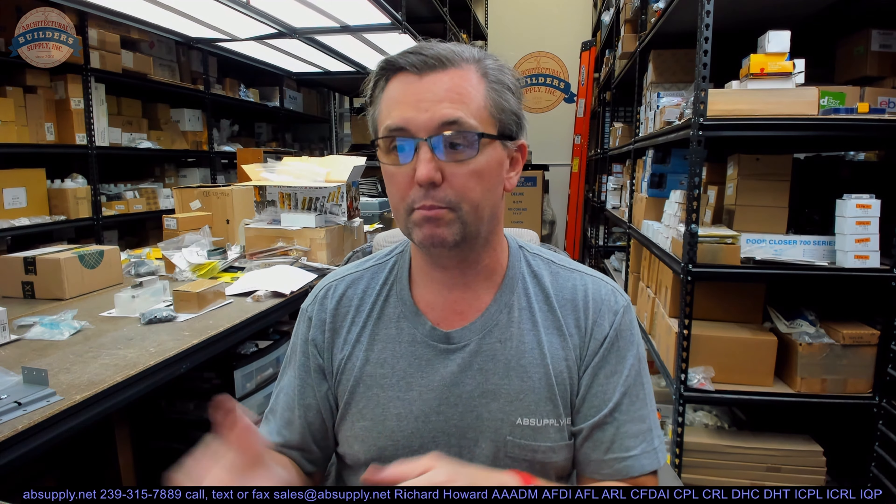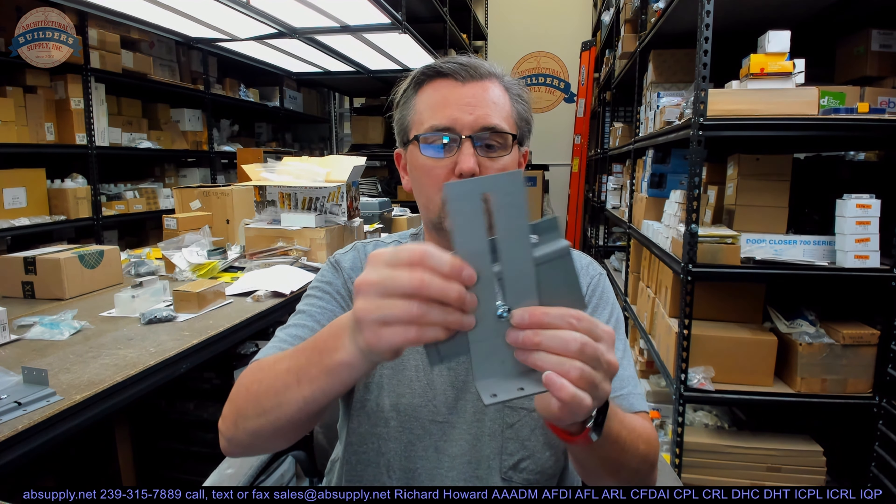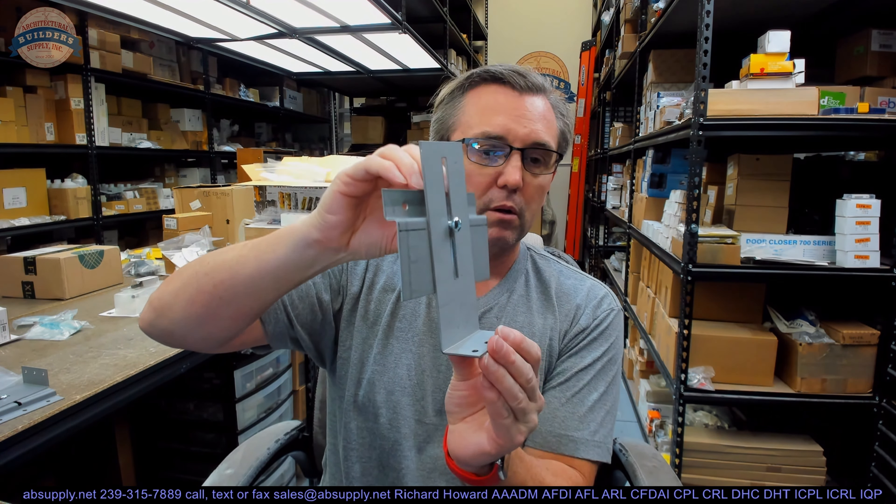How they fix the floor is how they fix the floor — more concrete, some sort of floor condition, or it is left that way. In a heavy construction project with lots of masonry, poured masonry, is where I would see these frames all the time. You could also obviously use it where you have a floor that is just not level, whether new or a hundred-plus years old. The FR668 allows that vertical adjustment. Not uncommon in a hollow metal shop — I would certainly want to have a few of these laying around, but to bump into a last-minute need for several dozen or hundreds of these, I have never encountered that.